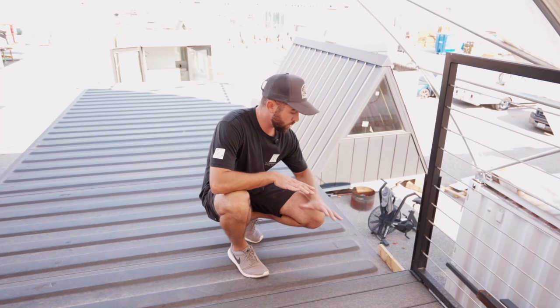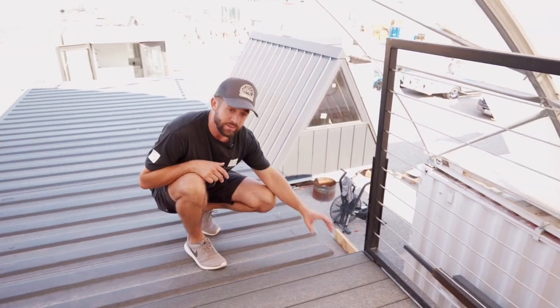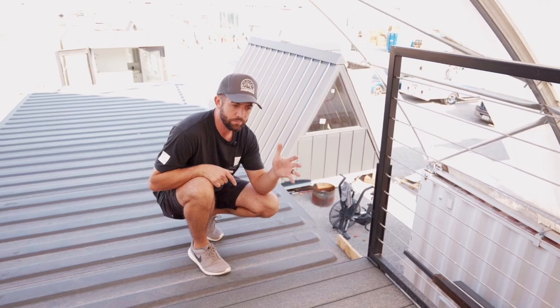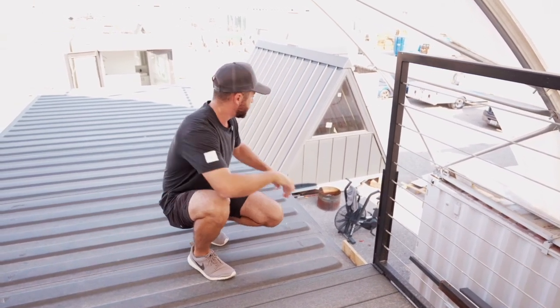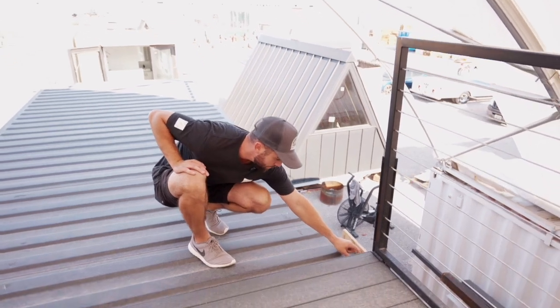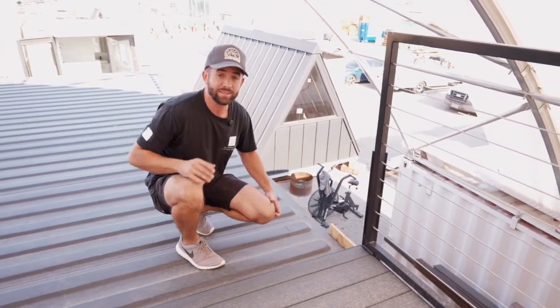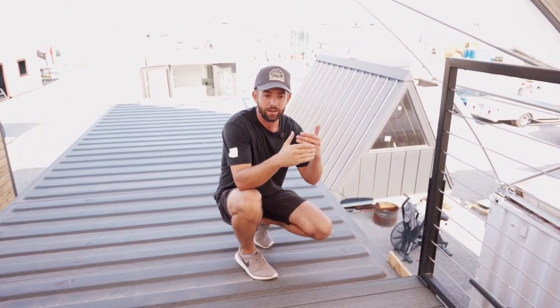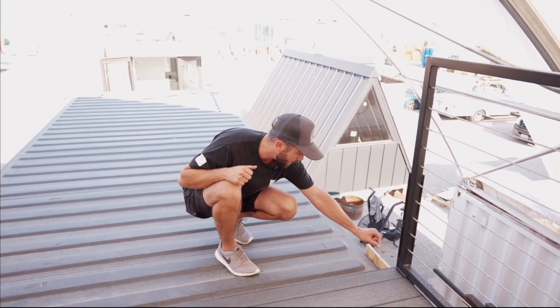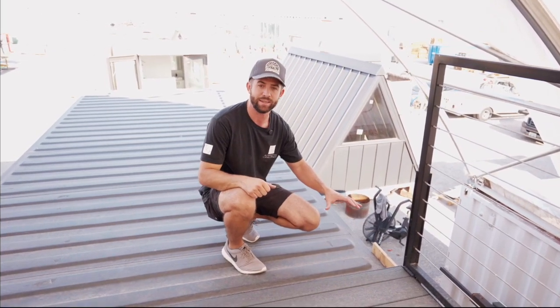For the front knuckle, it's going to land right here in this space. We're going to get a little metal spacer, probably close to about 1 inch or so. It's going to be whatever that height difference is from the knuckle to the container. That piece is going to go right here. It'll be about 3 inches by 6 inches. Similar to how we had 12 inches of continuous welding on that corner post, we'll weld around that and secure the knuckle to this end as well.